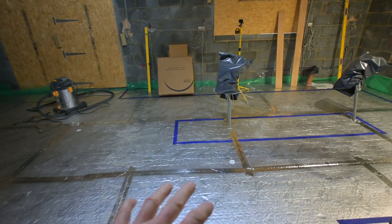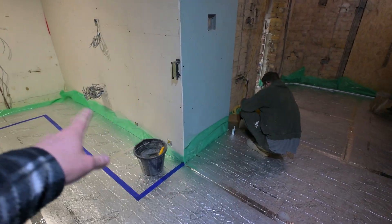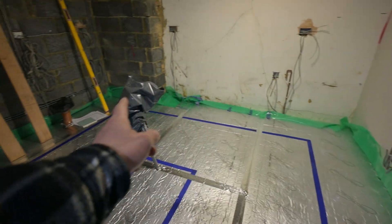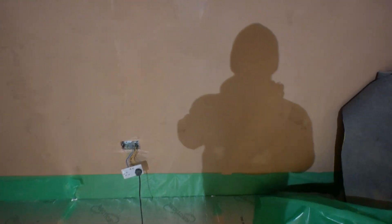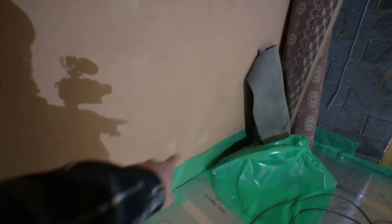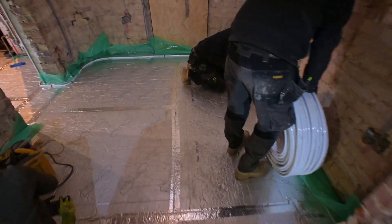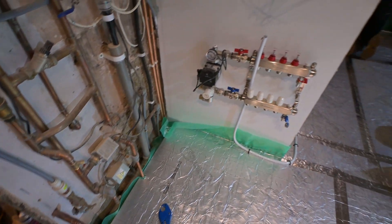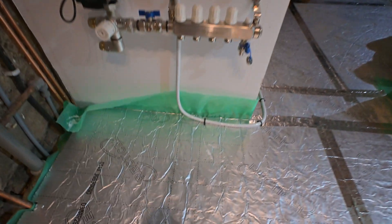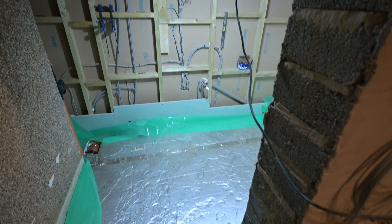The fourth layer of the floor is now accomplished — we've got 120mm Cellotex resting on the concrete slab. We added a membrane around the perimeter even though we already have the DPM underneath, just so the screed doesn't have direct contact with the wall. There will also be a foam strip for expansion. We've started on the underfloor heating — the manifold is installed, we've put up a piece of plasterboard painted white, and we're just starting on that now.